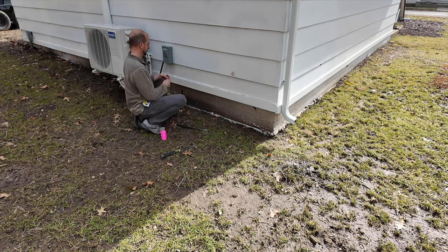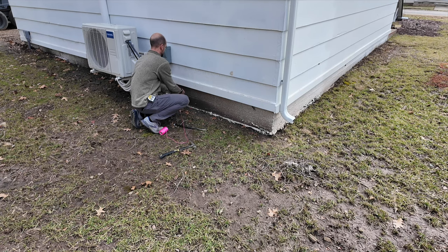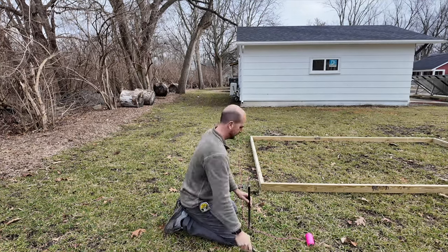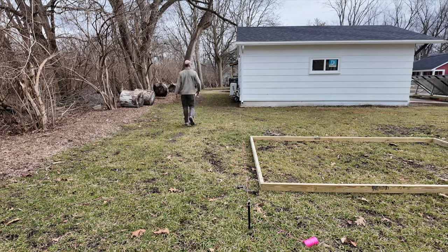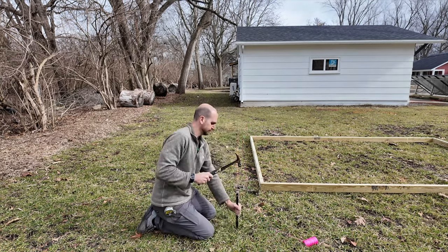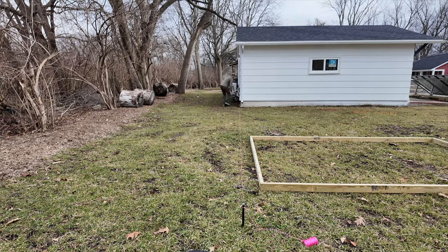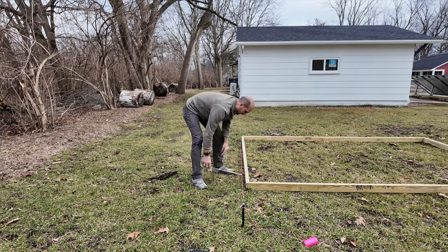There are a lot of different ways to locate the spot. I wanted to reference the detached garage and make sure the back of the shed lined up with the back of the garage. I put a stake in place and brought a string over to the shed location. Using the 8x12 perimeter floor framing as a reference, I took two measurements off the detached garage — when those measurements are exactly the same, the line is perfectly parallel and I know everything is lined up.